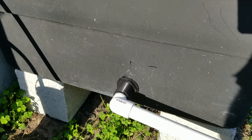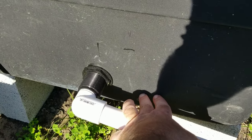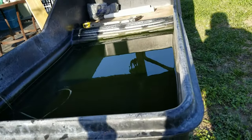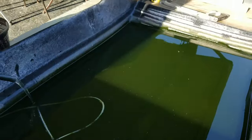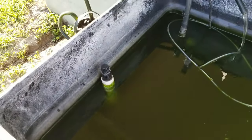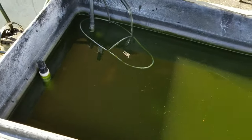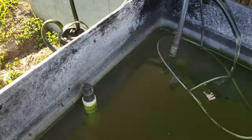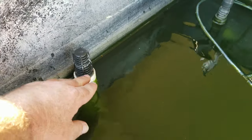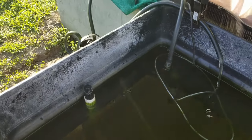I put the overflow low on this because I never know what I'm going to do — everything changes all the time. With this setup, I can drop the drain all the way low for very shallow water, or raise it up higher. I have a screen here so when the rains come and the water rises, it'll go down, and the screen makes sure no debris, fish, or turtles get sucked up in there.